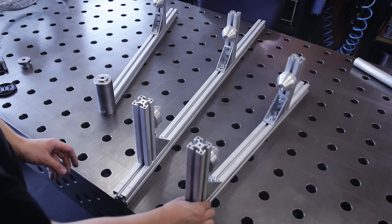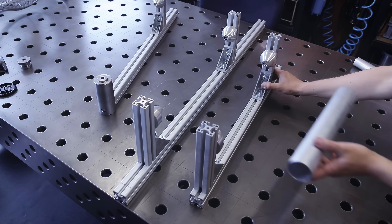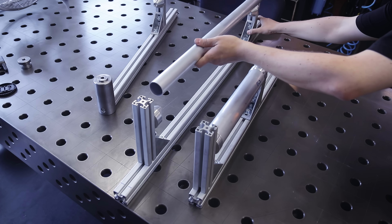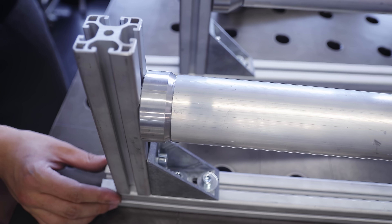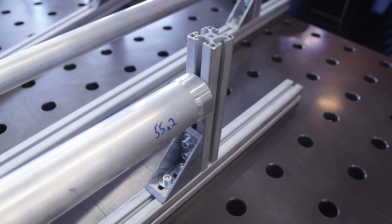The fixtures are ready to use — they're just free-floating on the table, so I clamp them down wherever I need them and use the table grid and various angle finders to set them up. To clamp a piece of tubing, it just gets inserted on the cones and when you push them together the tube slides to the center — and that's really all there is to it.